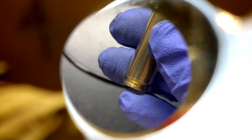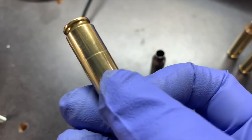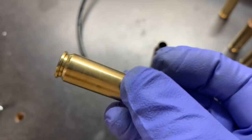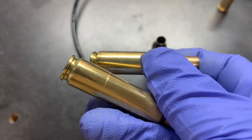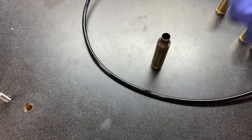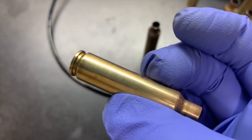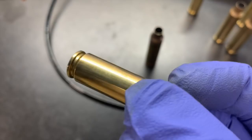So what does this all mean? It means you've got to look at your brass when you're cleaning it and when you're reloading. You need to look for signs. A lot of people who aren't familiar with reloading would pass this over, especially when it's a little less pronounced — like this one that just kind of has a little ghost line on it, not fully etched. You've got to know what this stuff is because it's how you stay safe and how you prevent problems. A line showing up doesn't mean you throw it away right away. If I wasn't shooting a match and was doing some testing, I might go ahead and load it up one more time, and that would probably be it.